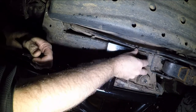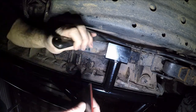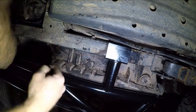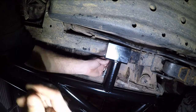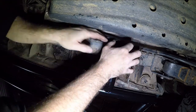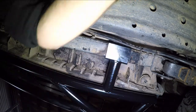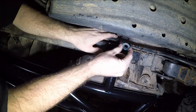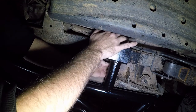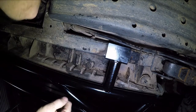So we'll use a spatula to attempt to move some things out of the way. Just want to slide that big washer up there, then we can get our bolt and drop it through the front here. Move that washer around to try and locate it — got it. Then put another washer on this side of the bolt over our big plate, just to make sure that spreads the load.